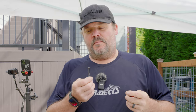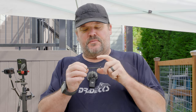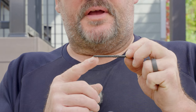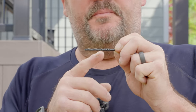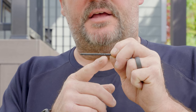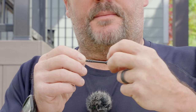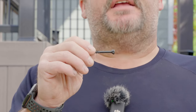They will not snap. The reason these are rated structural is — I don't know how many of you know how a screw is made, but it's usually run through some form of machine with a certain size and gauge of wire, then stamped, pressed, heated, or tempered. This particular screw has several different features: the very tip has fine sharp threads that help drive the screw into the material, then a standard thread that grabs the wood, then a reverse thread that helps clear the pathway for the head.